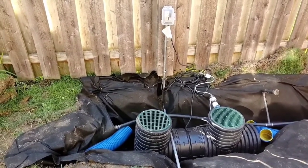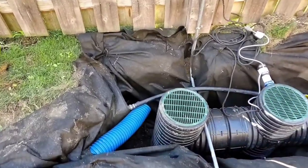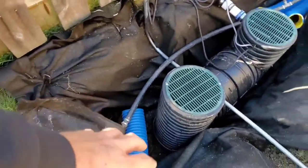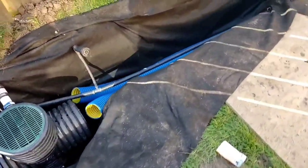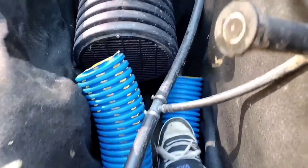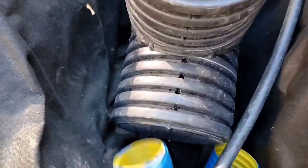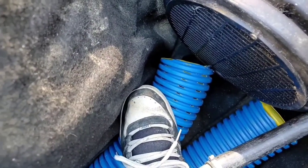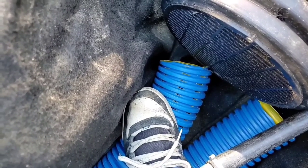Here's one of our micro screaming demon - set it and forget it. Downspout run with solid pipe comes here, the water just falls into the sump pit. Our yard drain pipe, which is a solid pipe with basins, goes right there. Then our french drain trench pipe - the perforated - goes right there. That creates that monster void at the bottom of your french drain that moves all that water.